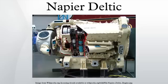Development began in 1947 and the first Deltic unit was produced in 1950. By January 1952, six engines were available, enough for full development and endurance trials. S212, a captured ex-German E-boat powered by three Mercedes-Benz diesel engines, was selected for these trials, since its power units were of approximately equal power to the new 18-cylinder Deltic engines. Two of the three Mercedes-Benz engines were replaced with Napier Deltics; the compactness of the Deltic was graphically illustrated — they were half the size of the original engines. The Deltic weighed one-fifth of its contemporaries of equivalent power.